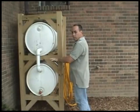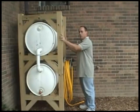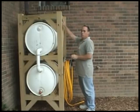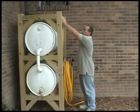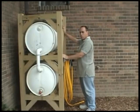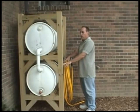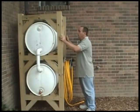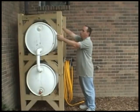Once you get that part set up, go to the back and do it the same as the front, then go ahead and start your middle — that's connecting them together. Take a two-foot two-by-four here, one catty-corner at a 45-degree angle, and then another two-by-four right here. That'll hold everything under the condition of the weight so it won't rock back and forth. Do it on the other side as well.